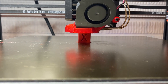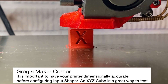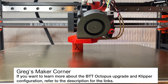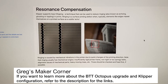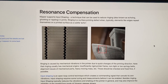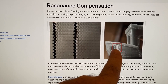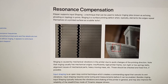After a lot of fine tuning I finally got the printer with the BigTreeTech board printing where I want it to be and pretty much how it was before. It is pretty amazing how much time it takes to get things set up with firmware, especially when you're doing a printer from scratch. Resonance compensation is one of the main reasons I wanted to go with Klipper on this board. As you can see in the picture, we're going to run this test and what it does is remove this ghosting — it's a software technique to basically compensate for any resonance that you have in your frame.